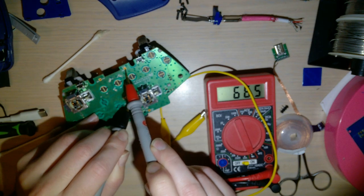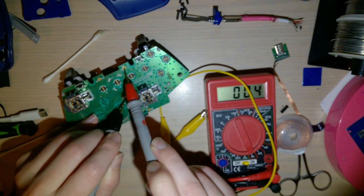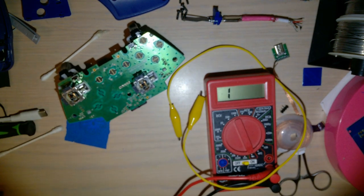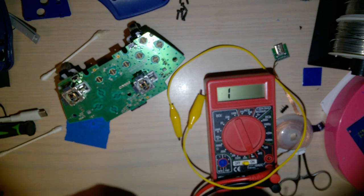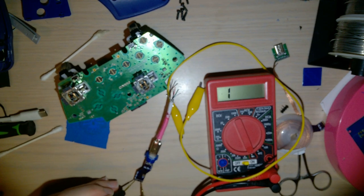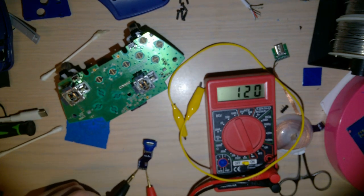And with the adapter, it had something like 6 ohm resistance. Alright, 600 ohms. That's about right. That's ground, and that should be voltage. Yep. Mark the beast. Oh, now it's 6667. Whatever. Okay, so the problem is then, is it my adapter or is it my soldering? I've noticed my connector is now weeble wobbling. That's probably a good sign. It is the connector. Whew, that's bad.